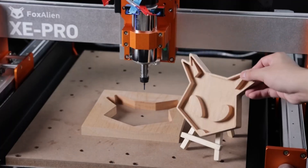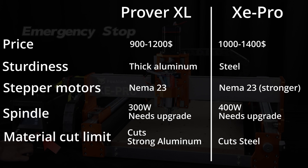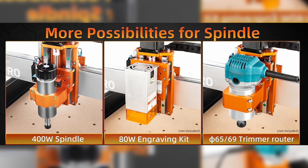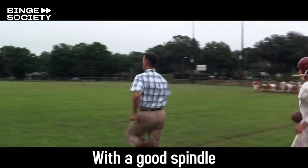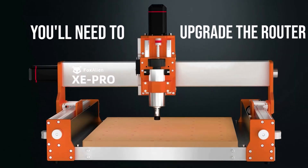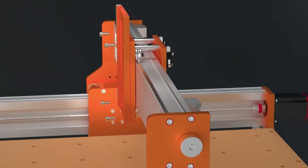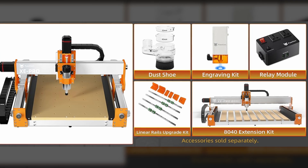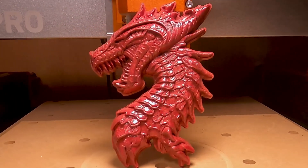And give you an accuracy of 0.05mm with the ability to cut everything you can imagine. The machine only has a 400-watt spindle — it's like running a marathon in flip flops while fasting in the desert. This means you'll need to upgrade the router using one of the provided attachments. Limit switches are on both sides and assembly is not too hard. You can customize the machine further with linear rail replacements on all axes and improve workspace with the extension pack. In short, the XE Pro is the Hulk — when it's angry, no competition. If you care about precision and power and are willing to pay the price for it, the Hulk is what you need.